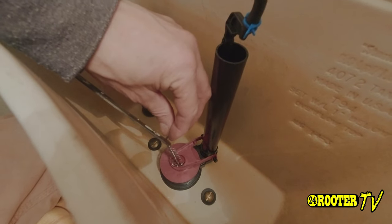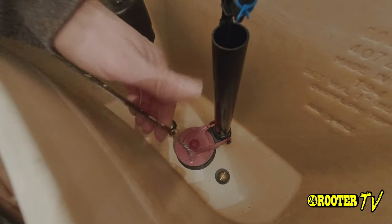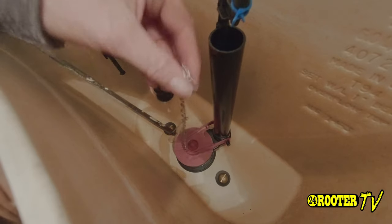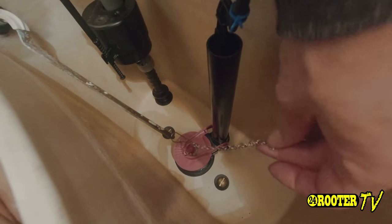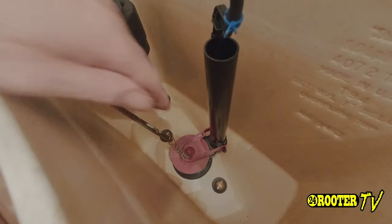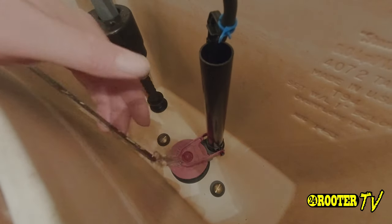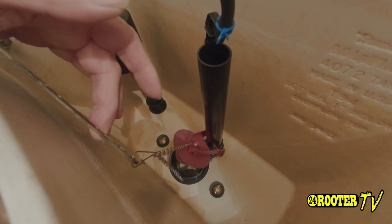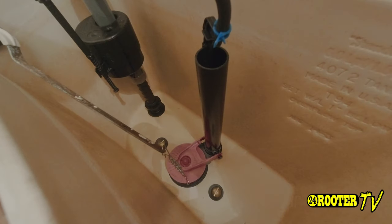In this case we're going to have to add a little more. Now we have very little gap, but you'll notice we have this excess of chain, so we want to snip that off with dykes so that it doesn't accidentally go out and get trapped underneath the flapper. See how that's flying around in there — so it doesn't accidentally go down and get trapped underneath the flapper.